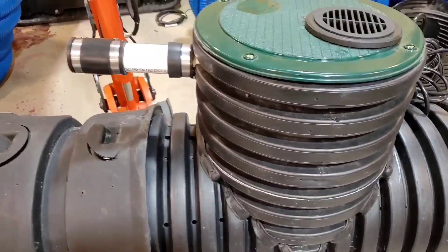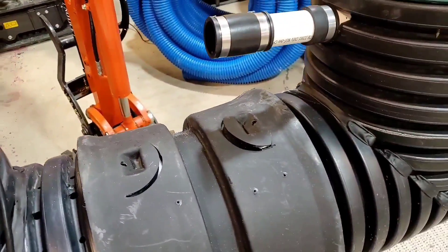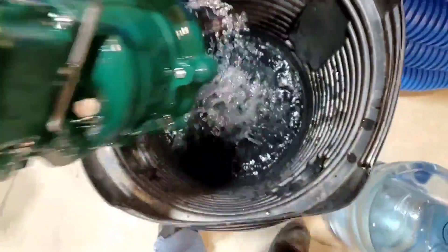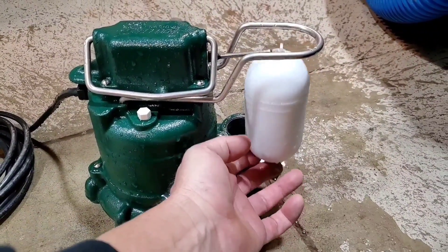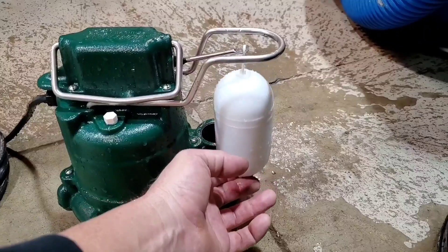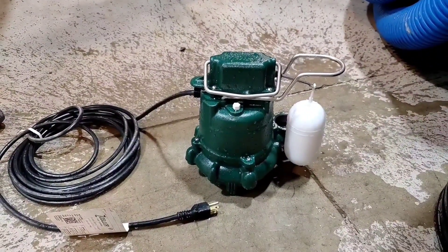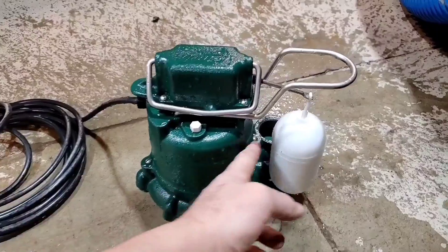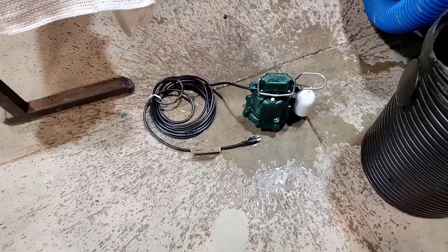Why is this significant to the longevity of your yard system? If you want minimum maintenance, the key is in the switch of the sump pump. Just five gallons triggers this pump — five gallons fills it, it runs, five gallons fills it again, click, runs it out, over and over. Think about that — five gallons at a time. 99 out of 100 sump pump failures are in the switch mechanism; it just gets overworked.